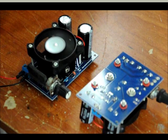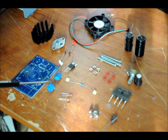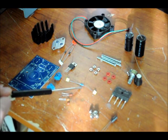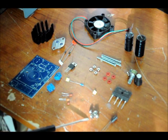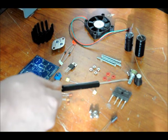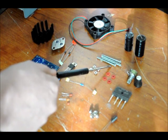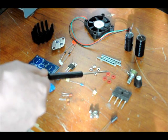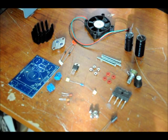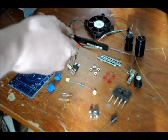Let's start off with the bag of components. We have our PCB, our two terminal blocks for input and output, three 100 nanofarad ceramic capacitors, one 200 ohm resistor, screws and nuts for mounting the LM338 and the heatsink, a 10 microfarad capacitor, your bridge rectifier, your variable resistor and variable resistor cap, four screws, four nuts, and four washers for mounting the fan, your LM7812 regulator for the fan, two power diodes, your LM338, your heatsink, your fan, and your two power capacitors at the output.